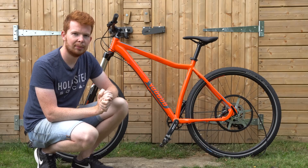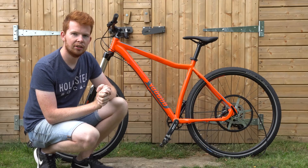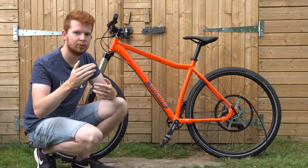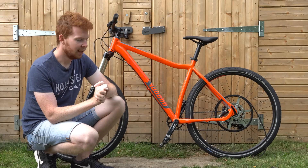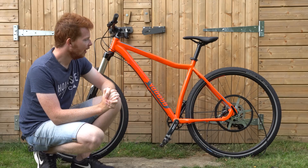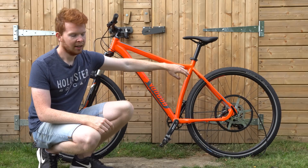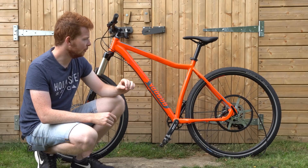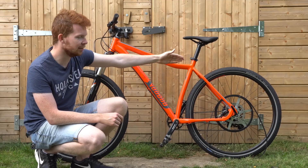At the end of last week's video I briefly mentioned that I was going to redesign the motor mount system to utilise a dual pulley stage step down rather than a single stage step down. I've looked and thought quite hard about how to do this two stage step down and I've come to the conclusion that it just isn't going to fit on the rear. There were a number of other issues with the design being mounted at the rear, as well as not being able to fit in a two stage step down.